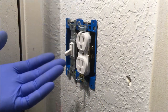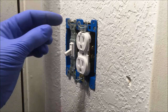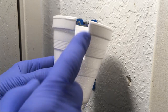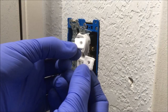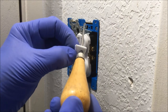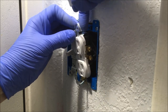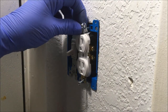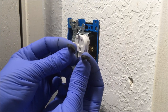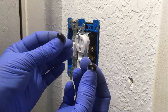The other things I'll show you require you to bring the screws all the way out so you can get something behind them. You can use styrofoam — I cut a piece out of it, cut the strip into little squares, and used an ice pick to make a hole. You can put the styrofoam squares on that screw and screw it in. You can also use washers, flat or beveled, just depending on how much you have to bring out that outlet or light switch.